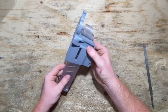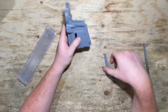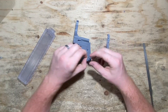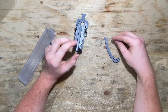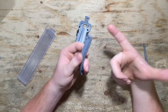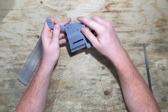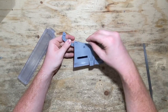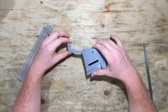Just finished filing that for a quick minute, and now the magazine fits nicely and nice and loose — that's how we like it. So we remember it's going to be the top hole we want to line up. We're going to take two itty-bitty 4-40 screws, and one is going to fit on either side in these cutout holes. They're not going to go all the way through — what they're going to do is poke through just enough for the tips to fit into the hole on either side, pinching on the hole and adding a bit of an axis for it to rotate. We need to hold this in place, line up the hole so we can see light through it, and put in the screw from the top. You'll know you have it lined up when you can pivot it but can't really pull it out of place.